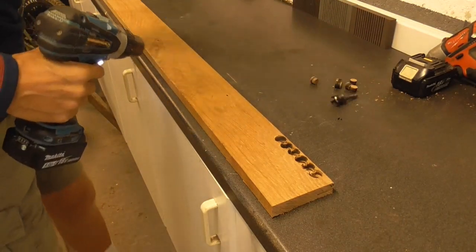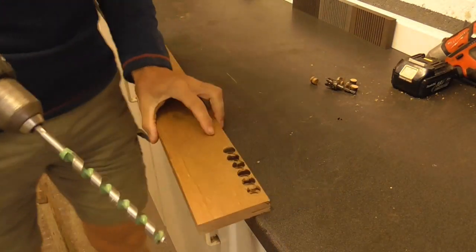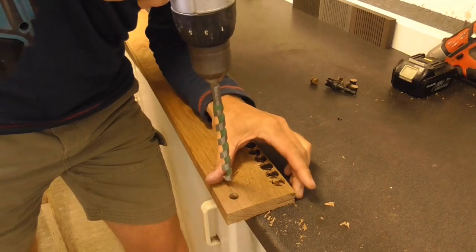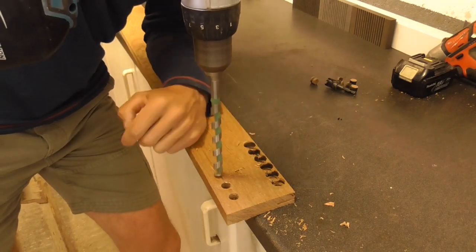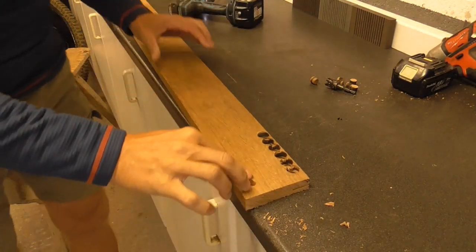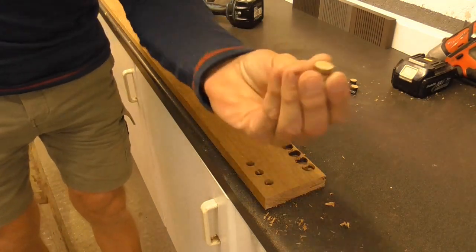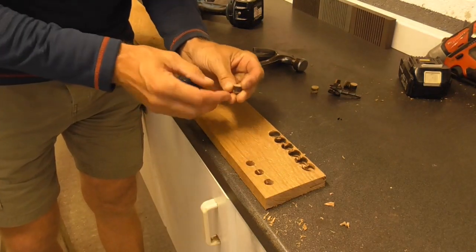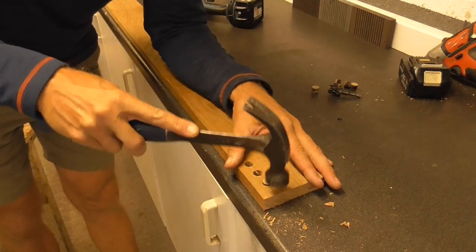Let's finish the video by doing a couple of half-inch holes and seeing how nicely those pellets go in. I've got my lovely flat-topped pellet, and you can see quite easily from the nice cut end which way the grain goes — which helps when you're pelleting to line the grain up. Let's stick one in there — look at that, lovely. Bank it down wherever you want it — maybe just leave it a millimetre or so above.